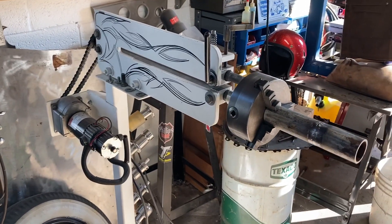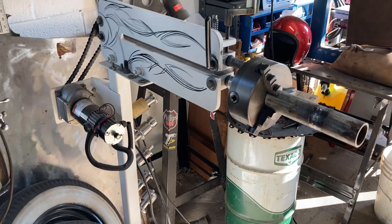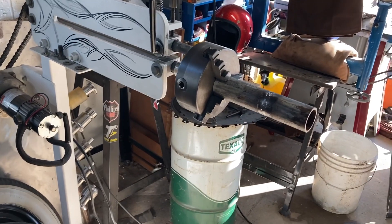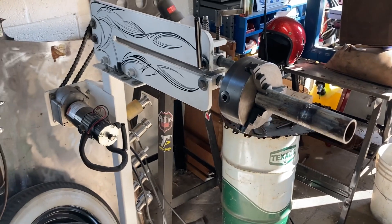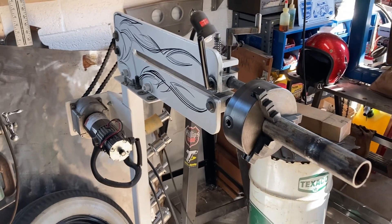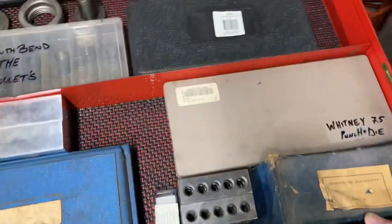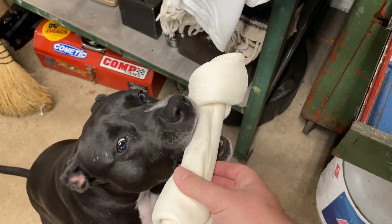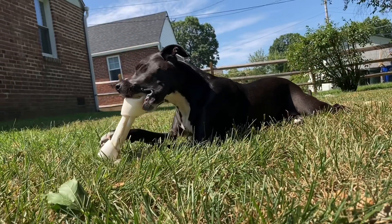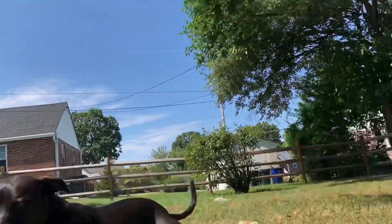If you have a homemade bead roller like this, or if you have an Eastwood machine — I don't know exactly how slow those machines can go — but if you have something that can go a little bit slower than this one, then it's worthwhile to make yourself an adapter and run a three-jaw chuck in there. You can even pick up a three-jaw chuck off of a wood lathe; it's probably even cheaper that way. A three-jaw chuck in the bead roller makes a nice horizontal positioner. Thanks for watching. I'll see you next time.